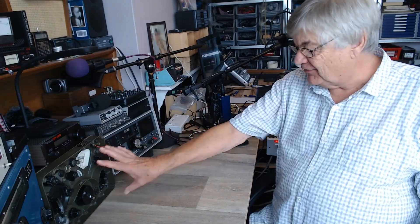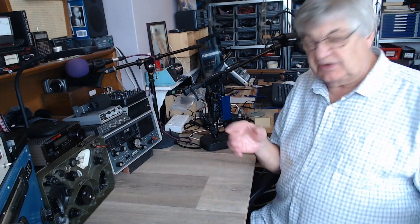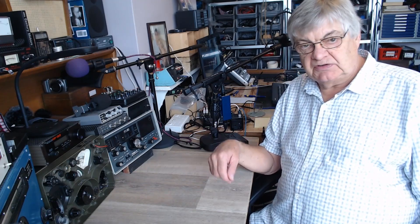At least I've got the R209 working — I love that, it's a brilliant radio. So what I've got to do is find out what valves are in there. They've been changed to 12 volt heaters — they were 6.3 volt, so I must put 12.6 volts. That's fine. But are they the correct valves? The output valve is incorrect and it's not even wired to the output transformer. If I can get hold of a 6V6 — I've got rid of most of my valves since I retired — I need a 6V6. Get the audio amp working properly. Then also check the other valves. Are they the correct ones? If they've taken the control grid leads under the chassis to the control grid pin, I'll probably leave it like that. Otherwise it means buying a complete set of valves, or the ones with top caps at least, and putting the wiring back to the top. That would be the best way to get it original. Once the radio is all up and running, that might be something to think about for the future.